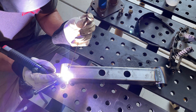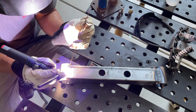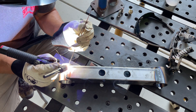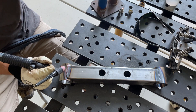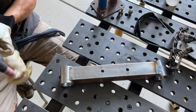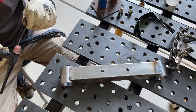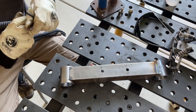As far as welding goes, I'm not going to give a formal instruction, but I'll tell you what I do. I'm using two different welding techniques here. The first is pulsing the pedal with my foot - every time you hear the welder go 'wah wah wah,' that's me pushing down and releasing. The benefit is it helps me control speed: I push down, I'm welding, I come back up, and my hand is in exactly the right position. I can pause with my foot up, get the filler rod positioned just right before going back in. I also never weld with a bad tungsten - I keep about 30 sharp tungstens in that little jar, and as soon as I see the color change in my helmet I immediately swap it out.